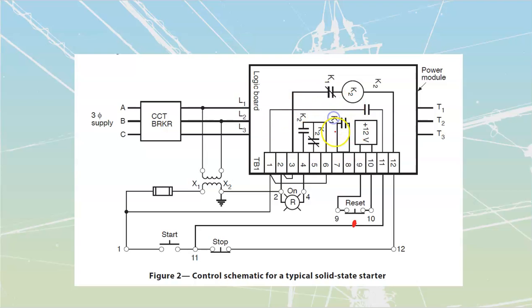Occasionally you could run into something like this where everything runs through the actual components. If you follow it through, it still follows our regular control components. We've got a fuse inside here — this is power, we'll call that the hot line. On this side you see they've got a control transformer that's been grounded down, so we'll call that neutral. To trace out the rest of the control circuit, you can see the start and stop shown here are going to carry power through the circuit.